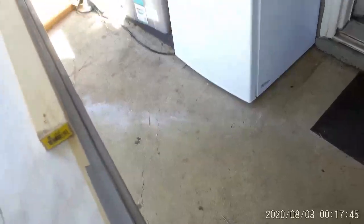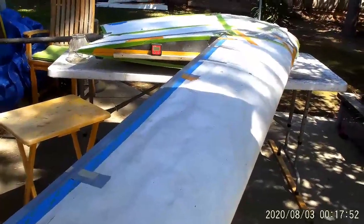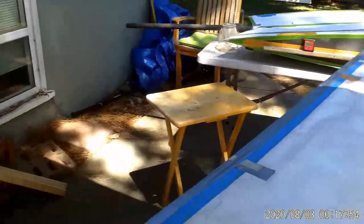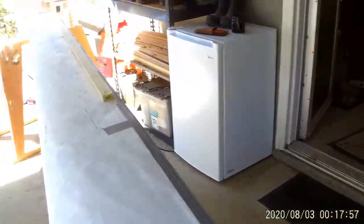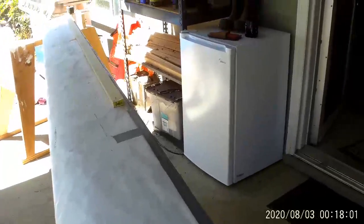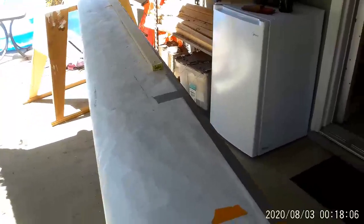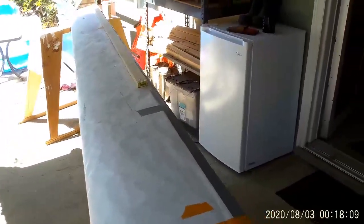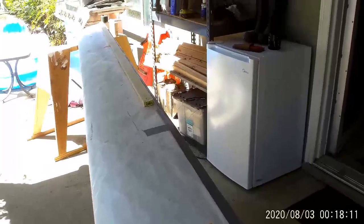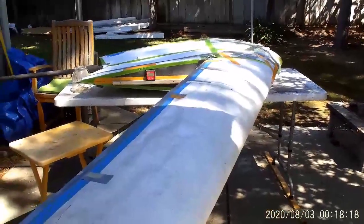This is a rather large job that has to be done quickly. There's about a one-hour gel time on the epoxy, so once we have this all set up onto the spar with all the glues in place, we'll have about 30 to 40 minutes to come out here, get this mounted in place, everything aligned and locked down and clamped while it sits for the final cure.